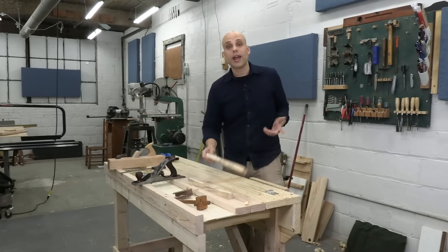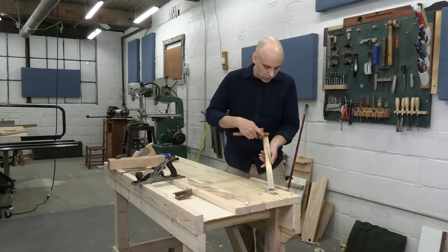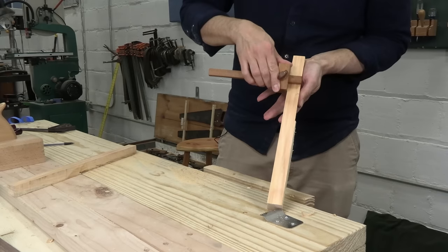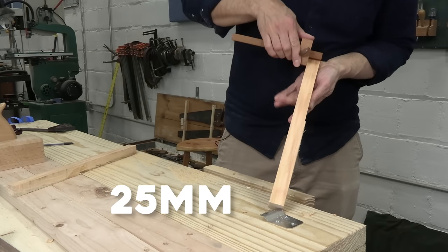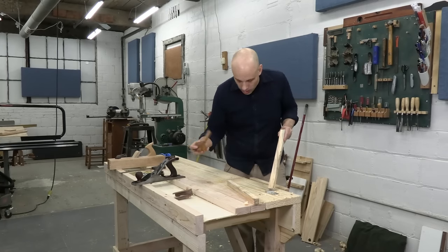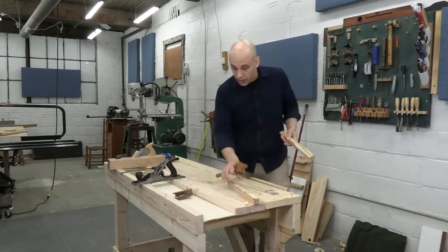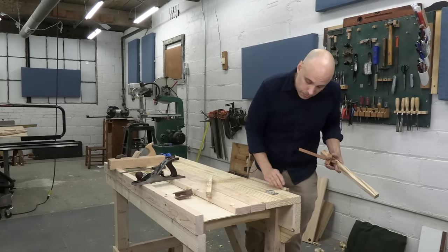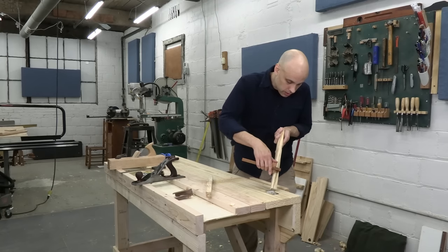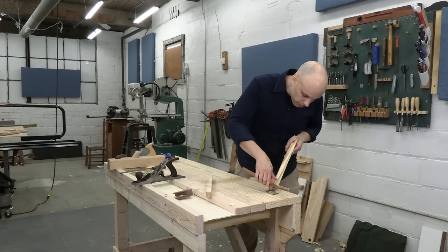Now what I want to do is figure out how much of this wood I can use — I made sure to allow myself extra. I'm going to set that gauge to the lowest point on the wood, and I have to check both pieces because whatever gauge setting I use has to work for both of them. I have a setting of just over an inch, and that's going to work fine for this piece. Let's check it against the other one — looks like I don't have quite an inch of wood there, and that's fine; this is completely non-critical. That setting is going to give me the maximum amount for each piece. I'm going to register against my known true edge and strike that line with firm but gentle pressure — no reason to try and do it in one shot, as the gauge will probably just wander off the piece. Flip the piece end for end so you're still registering against the same face.